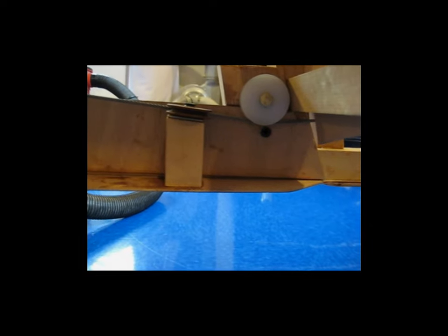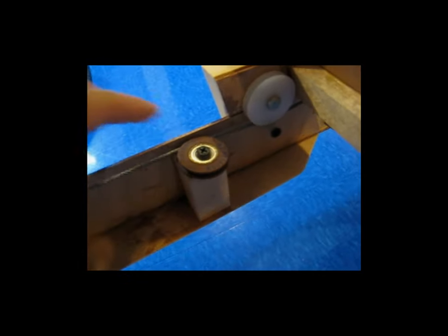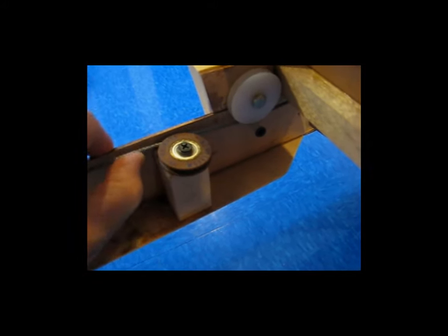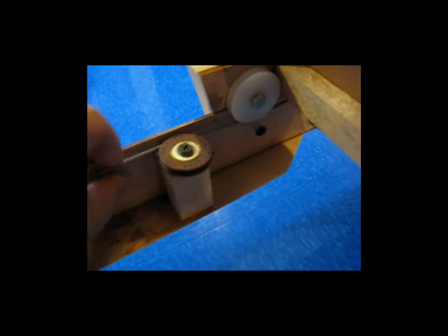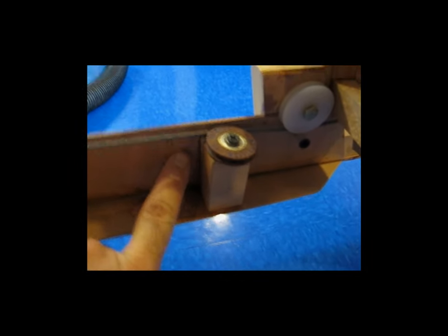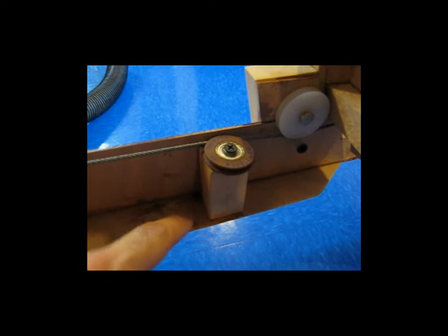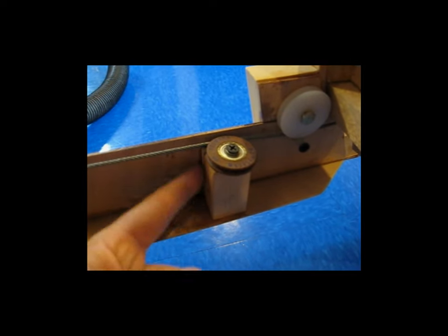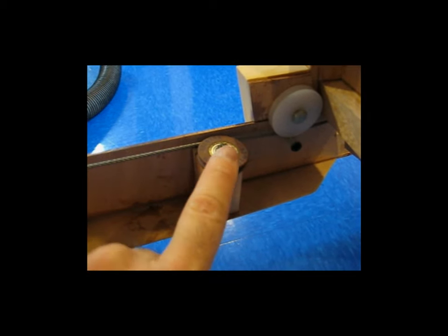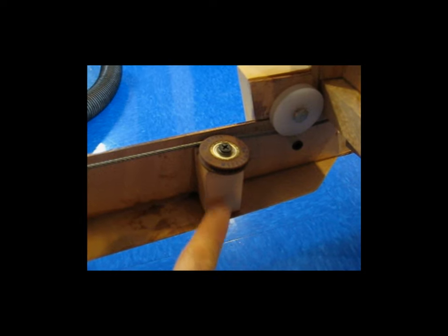You can see that the white pulley guides the cable up underneath the seat. I spaced the brown pulley so that the plywood here basically acts as the cable guard, preventing the cable from coming out and around the pulley. It's epoxied here and here. I've got some plywood to space it off, and a piece of plywood for the screw to go through to reinforce the spruce a little bit.